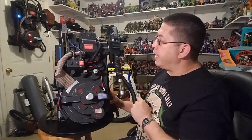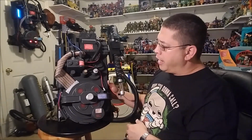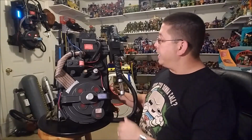Finally, I got a Velleman LED chaser kit. They're about $8 on Amazon. It's an 8 LED chaser kit, and I wired that in there with a 9-volt battery, and I put the LEDs in the order of 1, 2, 3, 4, 5, 6, 7, 8. So that when you turn it on, you've got a rotating cyclotron and a rising power bar, all on one circuit for $8. Super cheap. Looked fantastic, and again, the original gun electronics still worked.